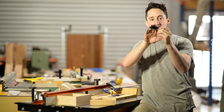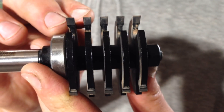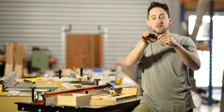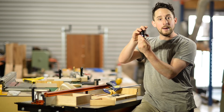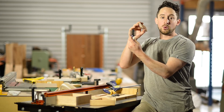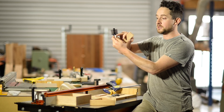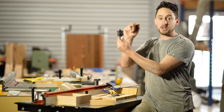Basically you've got five little blades. Each one is four millimetres thick and the gaps are four millimetres thick as well, so the tongue and grooves of these little sections all join together perfectly. With five of these, the whole cutting height is 36 millimetres, but the easiest height of join to cut is 40 millimetres without raising or changing the height of this cutter. You've got these five teeth which add up to 36 millimetres, and then you want to leave space for one additional tooth — that last four millimetres — which brings it up to 40.